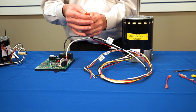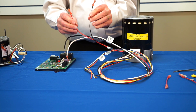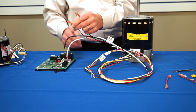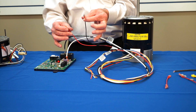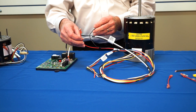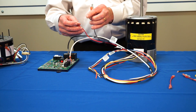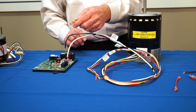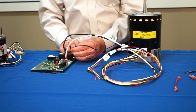Since I'm replacing a PSC rather than an EC, I only need one of the signal wires. Since this is replacing a PSC, I will use the black signal wire. If I were replacing a constant torque EC, I would use the red signal wire. In this case, since I'm replacing the PSC, I'll cap off the red and attach the black signal wire to my cool terminal on the board.